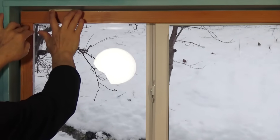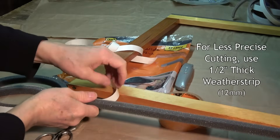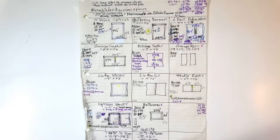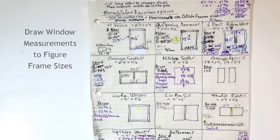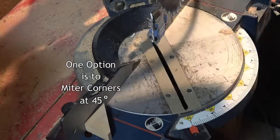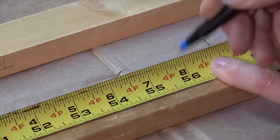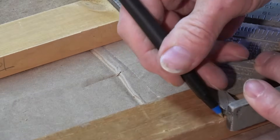If it's too tight, it will be hard to get in and out. If your windows are not very straight or you don't want to be so exact, you can use ½ inch thick weather strip, or make your frame ½ inch smaller than the opening and measure to about the nearest ⅛ of an inch. Make drawings of all your windows and their measurements to figure out materials and frame sizes you'll need. One option for building your frames is to miter the corners at a 45 degree angle, which uses slightly more wood, shorter screws, and is easier to figure the lengths to cut. I didn't mind cutting the ends square — it helps to measure and cut accurately.